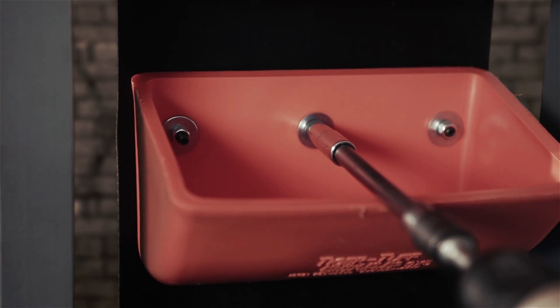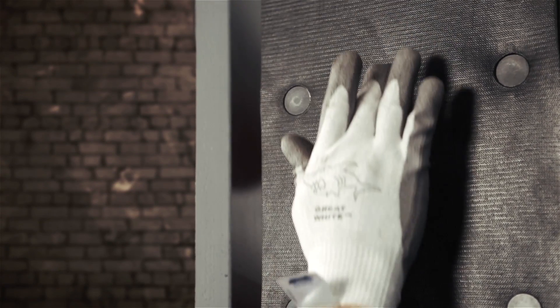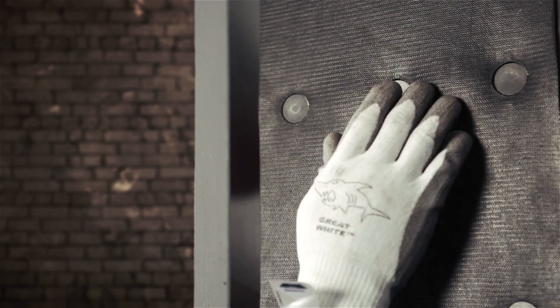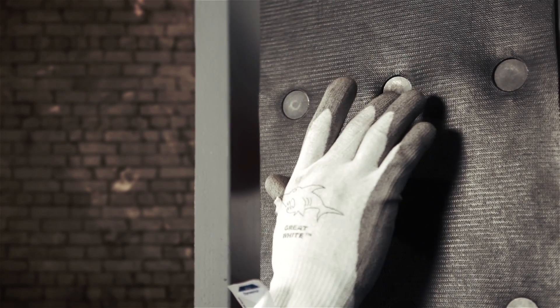If your bolt is into your belt and not flush, you're too tight. You've got humps between your bolts — this is the first thing that wears out. When this goes over your pulleys, the rubber will be worn off first, then it's going to wear through your plies. And this will be a failure to your bolt.